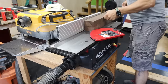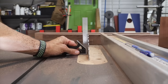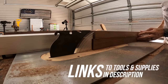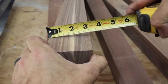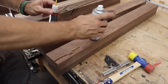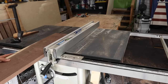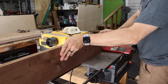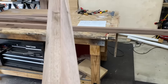First thing I did was joint two sides and then I planed one side. Once that was done, I checked for square on my table saw and ripped these legs down to three inches wide. These CMT blades — I can't rave enough about them. That's a 40 tooth blade from CMT. I'll link all the tools and supplies in the description. Three by three and perfectly square. I cut them to length and then used some CA glue to fill any cracks and knot holes in the leg. I had to joint some of the longer, thinner stock with a straight edge and the circular saw before running it through the table saw to start cutting out my aprons. I cut all the pieces of the aprons out using the table saw.